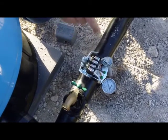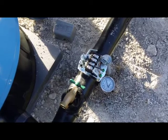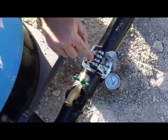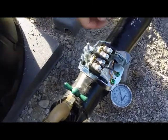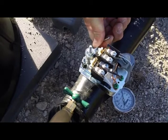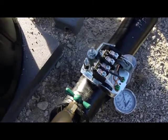Now don't touch the wires inside of there — they're hot. I've turned the power off for this demonstration so that I can touch things and you can see what's going on. What we have right here are electrical points that make an electrical connection when this arm slaps shut. Water pressure pushes up the tube underneath it, and when the water pressure gets high, the points open and the pump cuts off. When the pressure gets low, the points slap shut and turn the pump back on.